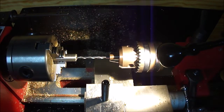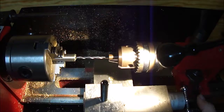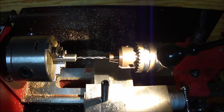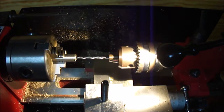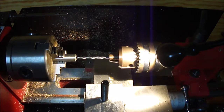This next drill is a little bit smaller than the ruby that's going to be going in, but I'm not sure if it's going to be tight enough just yet for the press fit. Either way, we want to drill straight through — not straight through the rod, the rod's going way back — but straight through the length of how long the stem's going to be.